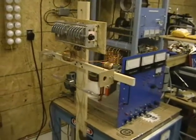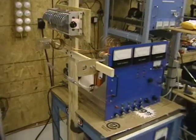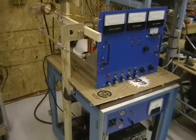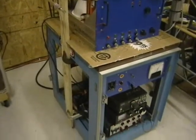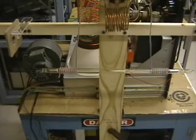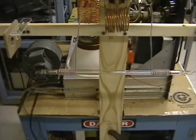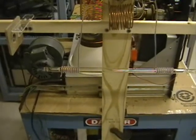This is a video showing an experimental high-powered Rife system using the original Rife frequencies of 11.78 MHz and 11.43 MHz as determined by Royal Raymond Rife. At the present time, the system consists of a 1.5-inch diameter by 18-inch long Rife tube filled with a mixture of 90% helium and 10% neon.